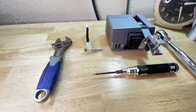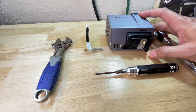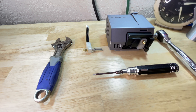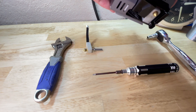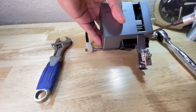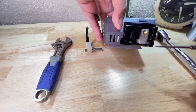Open the door and inside you'll find a small screw that you are going to loosen. First warning: make sure that when you grab your Snapmaker printing head, you don't grab it by the leveling sensor. If you grab it there, you can end up moving it up — which I ended up doing — and you can damage your bed. So make sure you don't grab it there. Loosen the screw and then pull the whole hot end assembly from inside the module.